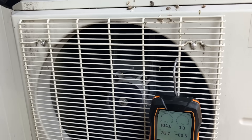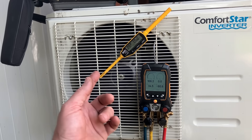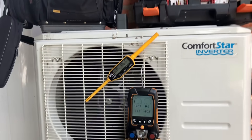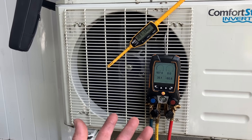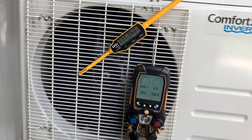I've got some nice discharge air coming out of here — nice and toasty. I'm going to grab my digital psychrometer and take a temperature reading from the condenser outlet. 85.5 degrees outdoor, 66 inside — not too shabby. We're now extracting heat from inside the home and discharging it outside by means of the copper line set, the evaporator coil, the condensing coil, the inverter, and the metering device — that's the refrigeration cycle. Reading 86.8, 86.9.